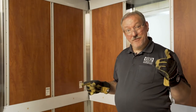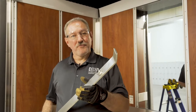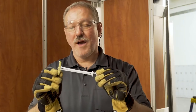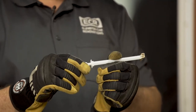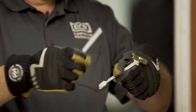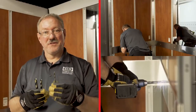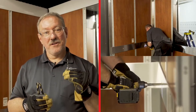Now we have to install the handrails, but first we have to remove the plastic from the handrail panel. Our handrails are installed from inside the cab using a split standoff. One side of the standoff is attached to the shell wall using togglers. The interesting thing about a toggler is it can be wide in the back when you need to attach your bolt, but narrow when you need to put it through the hole. Once you put it into the hole, you level it, slide the collar down into place to lock it, then snap off the white pieces — and you have an attachment through the wall behind the cab. You can then bolt your standoffs to the toggler. We drill the holes into the handrail panels in three steps: quarter inch, three-eighths, and half inch. The reason is that we're drilling through the panel and then through a steel shell, which can cause a lot of torque on your wrist and hurt you.